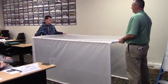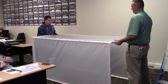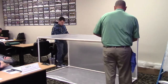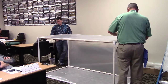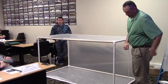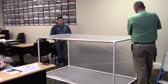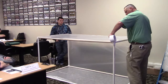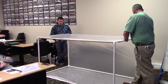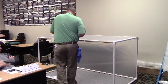Start in the middle first and roll to the edges — that will allow you to pull it tight. I already have another piece that's pre-cut that we'll use for the last side and the top and bottom. On one side I'm going to put a zipper, and on the other side we're going to do the triple flap doorway. I'll show you how to put one together — it can be done on any type of containment. It's a little bit easier to construct on the 2x4 containment, but you can do it on PVC or tension poles.